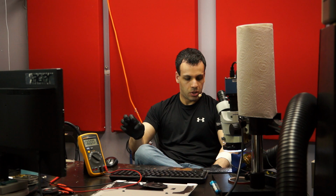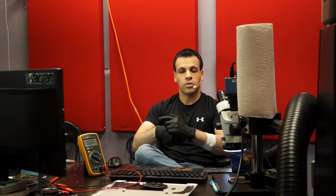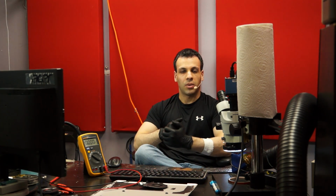Okay, so restart back here, and here we go. So SMC on off L, that has to be high, because if it's stuck low, the computer's going to think I'm holding the power button down. Holding the power button down is what causes the SMC to be reset. That's one of the ways you can reset the SMC, so that's one of the things I want to check. Does the chip have actual power going into it? Maybe the signal is low because the chip does not have power going into it.